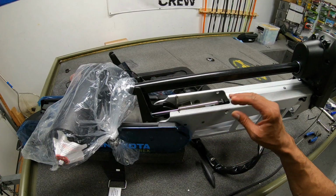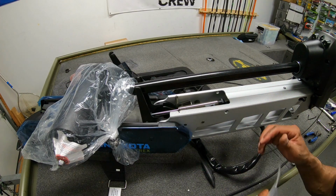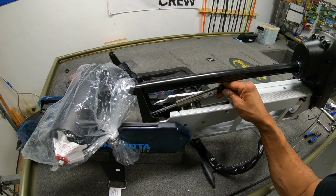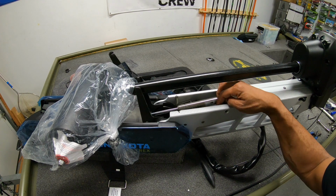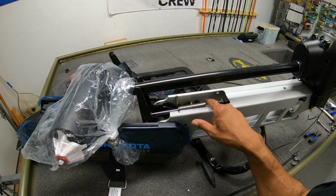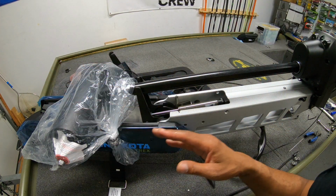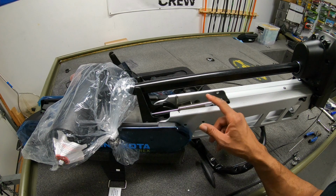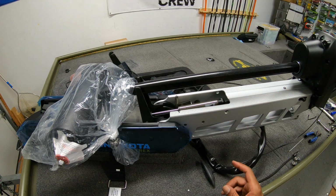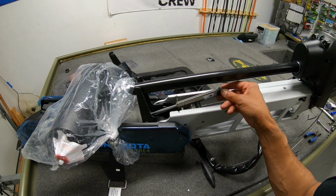At this point, you want to install the gas spring, which is basically the lift assist for this motor. There's a lot of instructions in the manual that say to really be careful not to damage this while you're installing the motor. So pay close attention to where this is, because if it's in the wrong place, when you go to deploy it, it will bang on the spring motor. It'll rest on it, bang on it, and you can damage this before you even get this thing totally installed. So just be very mindful of where this is at all times.